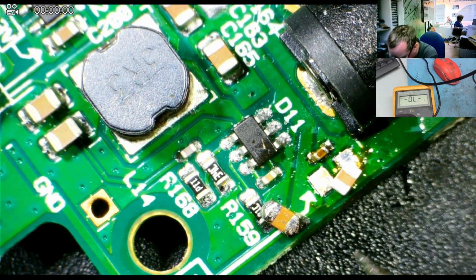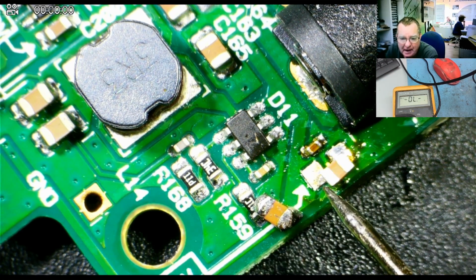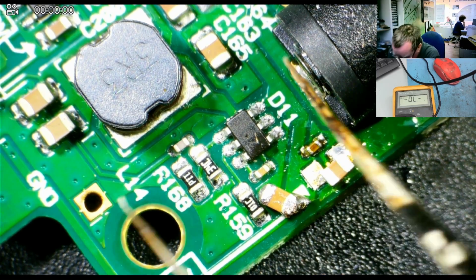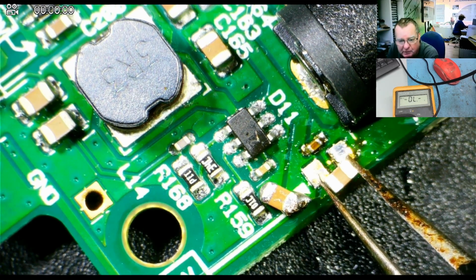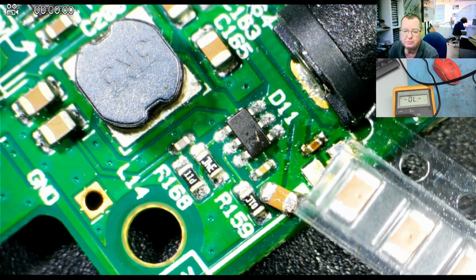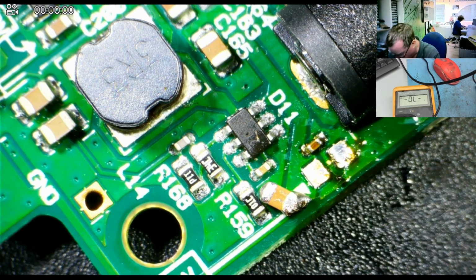Here is a capacitor. So this one is a 10 microfarad 0805. That's the size. SMD capacitor. It's smaller than this one. Now that may well mean it's a lower voltage. I'm pretty sure these are 25 volt capacitors in the 10 microfarads, but if I can find a slightly larger one that fits, it will be a higher voltage capacitor as well. So let me try the next size I have up, which is 1206. These are 1206. These are slightly bigger than the original, but I'm pretty sure I can get that to fit on there. So I'll actually use one of these. But I'm fairly sure the other one would work okay. Anyway, I think it's a high enough voltage.